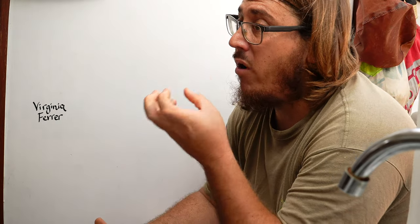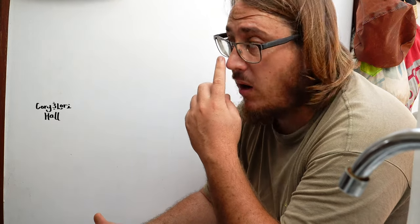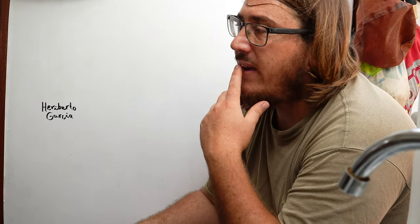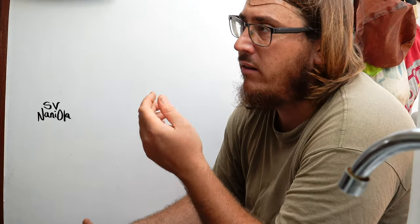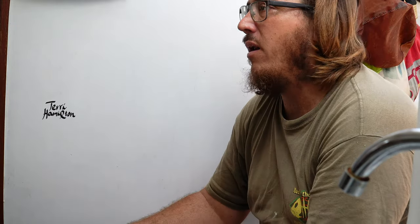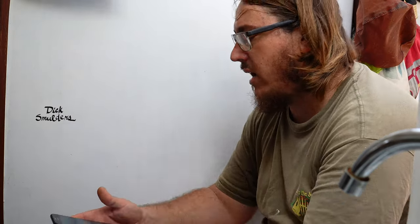So the oil is getting hot, not from the engine running. I think it's getting hot from the gearbox. And now there's so much slippage, so much friction between the cones. It's basically a friction welder at this point. Like when I leave the engine on forward gear a while, I literally cannot take the forward gear out anymore. It sticks. The hotter it gets, the more it sticks together.